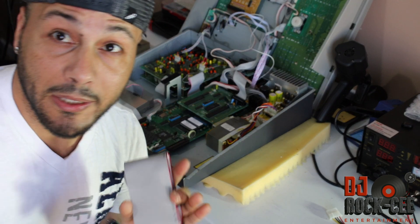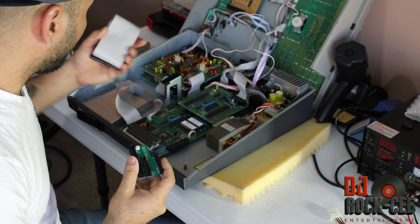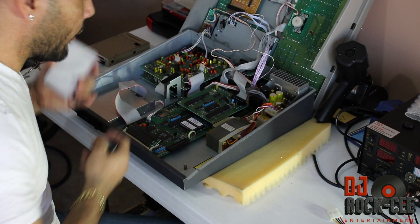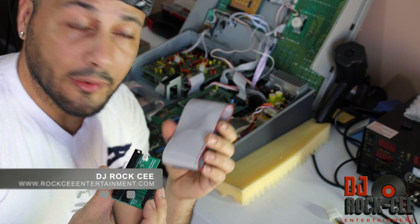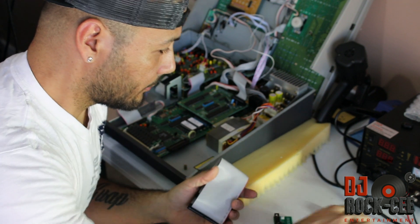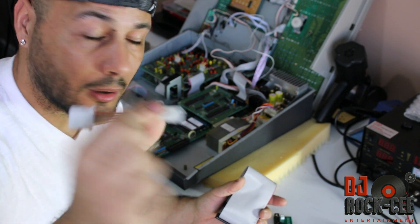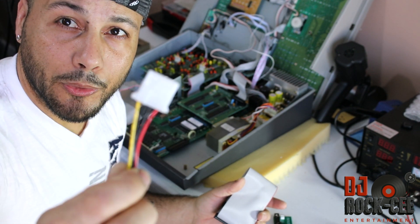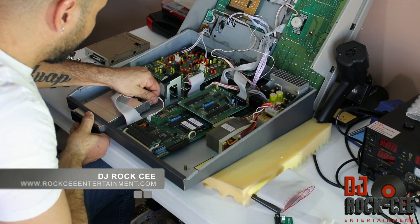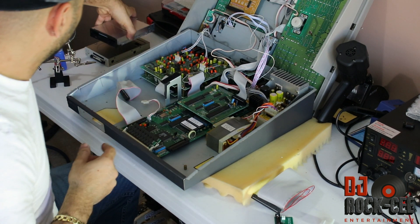To complete this job, you definitely need a kit. This will not work directly into your MPC. Remember that this MPC comes with a floppy drive, so we need to convert this into a SCSI 50-pin — so this will be your kit. You also need this wire to convert it from your regular small floppy power to your bigger size connector.